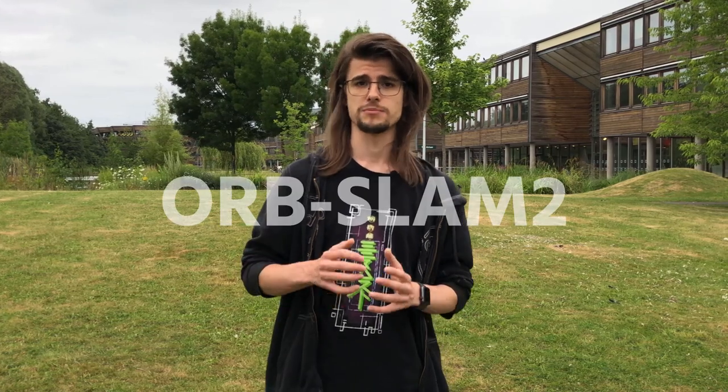You see, I was already streaming video to my ground station PC over Wi-Fi, and that PC, well, it has a lot more processing power to it. I think you can see where I'm going with this. Now, the actual process of building software that can handle visual odometry is a tall order. So instead, I used existing work named ORB-SLAM 2.